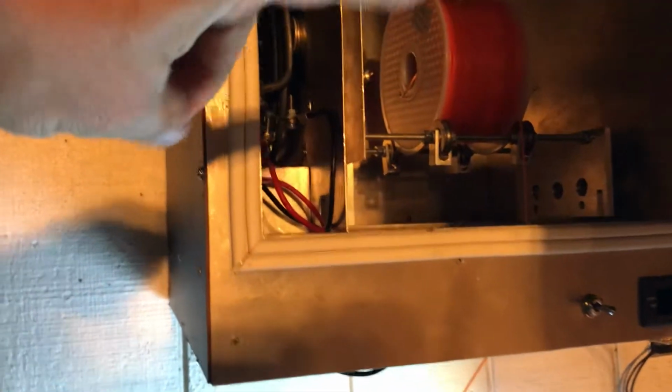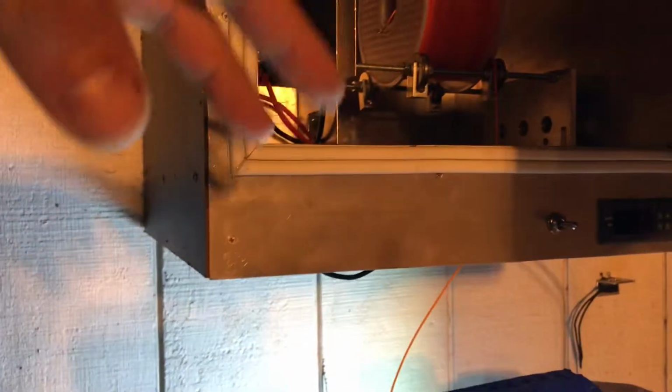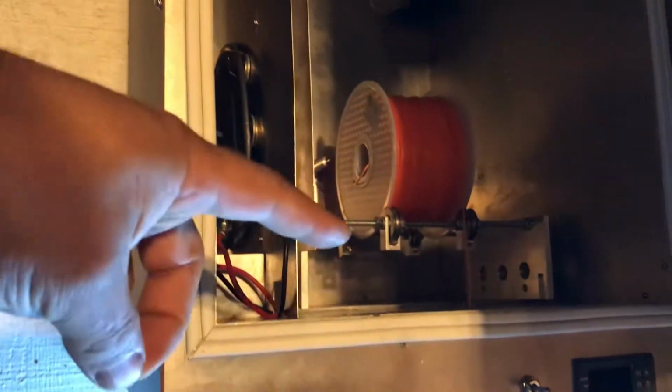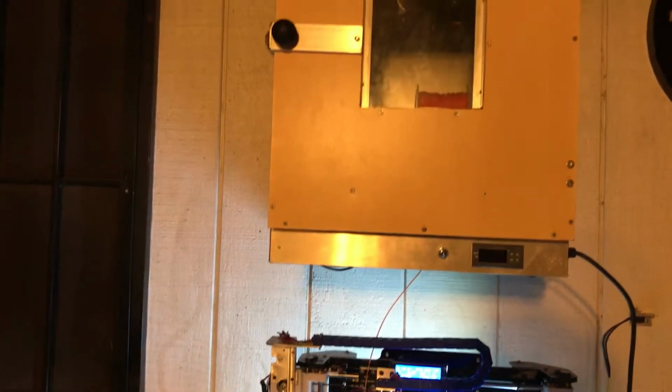And as I said, I built this oven here because I need to keep my filament dry, especially ABS. When you're printing ABS, you have to dry it constantly, because in 15 hours it can absorb moisture from the air, not just in general, but during printing. If you're printing 15-20 hours, it can absorb moisture from the air. That's why I constantly dry my filament during printing. That's why the surface quality is very nice. So the ABS must be dry if you want to get nice printing. This is one of the conditions of printing ABS.